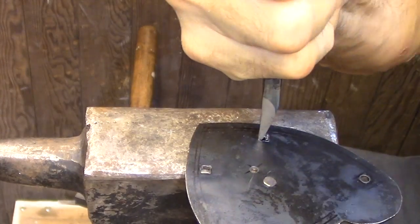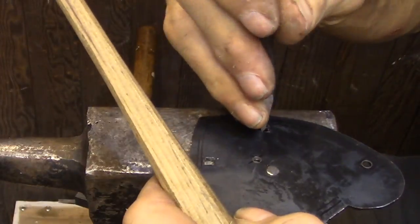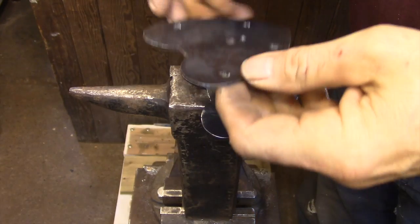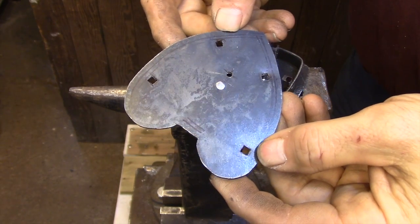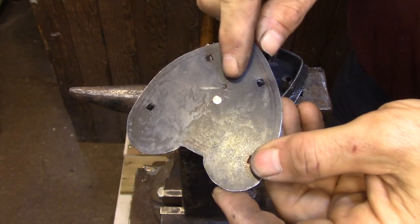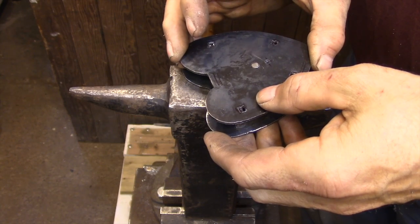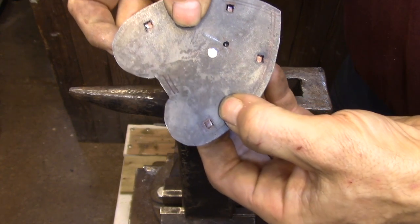The main thing that I'm trying to line up is the hole that I drilled for the keyhole, and I want that lining up as close as I can get it to the pivot pin that I've already riveted in place. These are the square holes that I made — they are cut around the first drill holes that I put into the cover plate and the back plate when I made those two pieces in the very first video. This center hole lines up perfectly with the pivot pin for the key. These holes were all in perfect alignment when I started out the lock because I drilled these two plates together so everything had to line up.